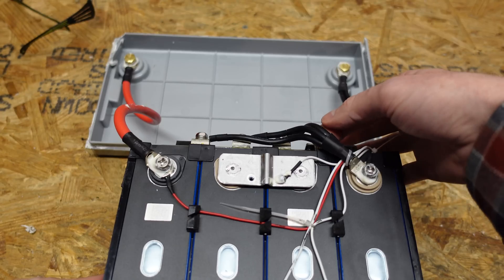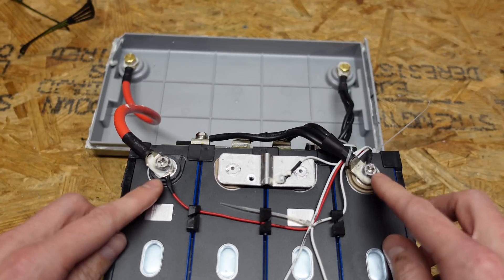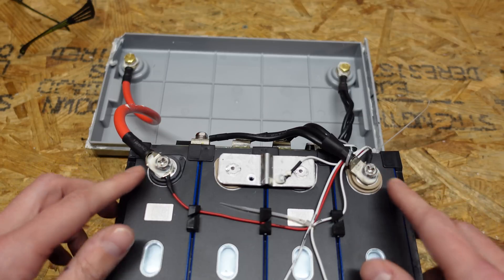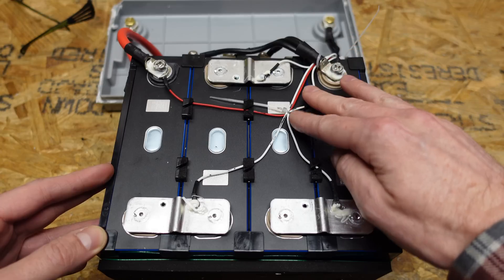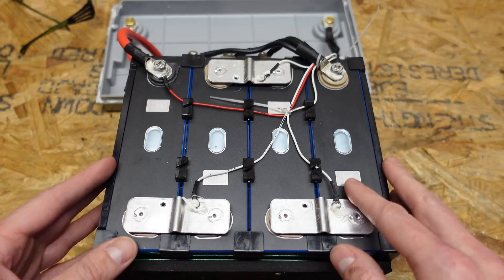Pretty standard. The negative is comprised of three 10 gauge silicone insulated wires, and the main positive and negative are bolted down to the battery — they are not laser welded. We can see each of the balance leads coming up for the series connections of the cells, fixed down nicely in the center of the battery, not floating around loose or bumping against other terminals.